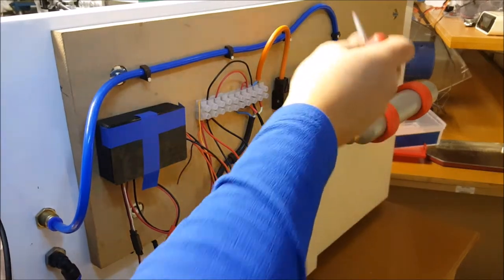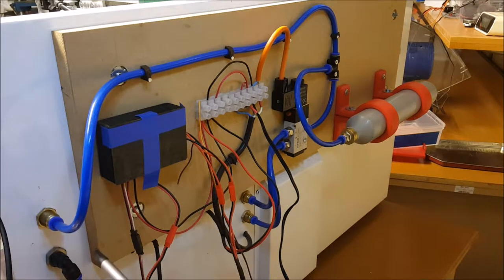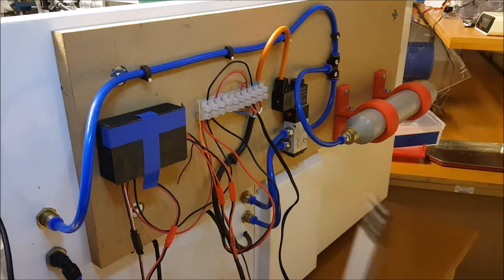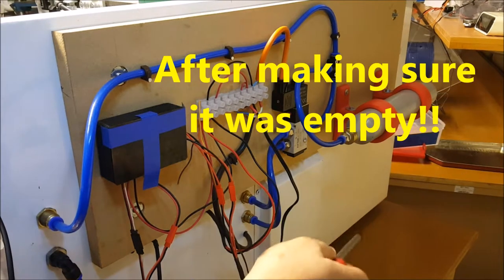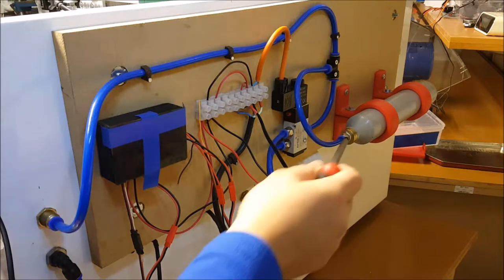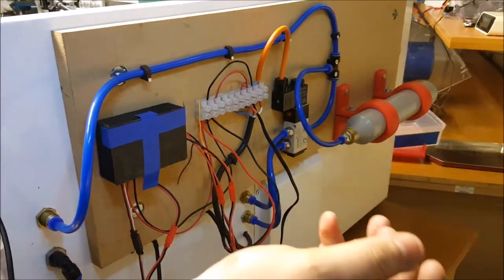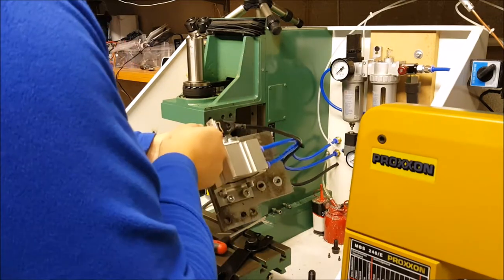There's some testing showing a whole lash-up of solenoid valve and everything here — that's all on the back of the machine now. What we've got: this is the solenoid valve, electrically operated by the switch — the wires for which come through here. These are the wires from the switch at the front; that's my 12-volt power supply to drive the solenoid. You've got the forward stroke and rear stroke lines that go off to the piston on the head of the mill, and the line feed that goes off to the regulator at the front — the line connector just plugs into my airline.